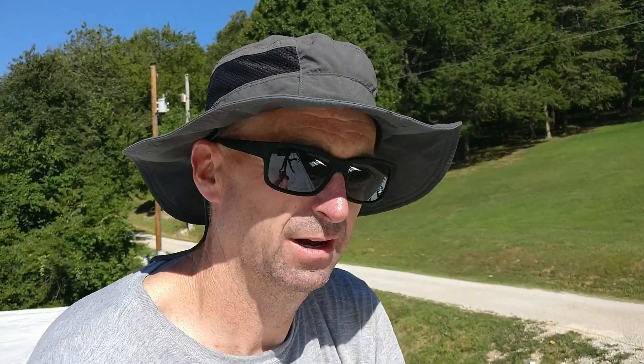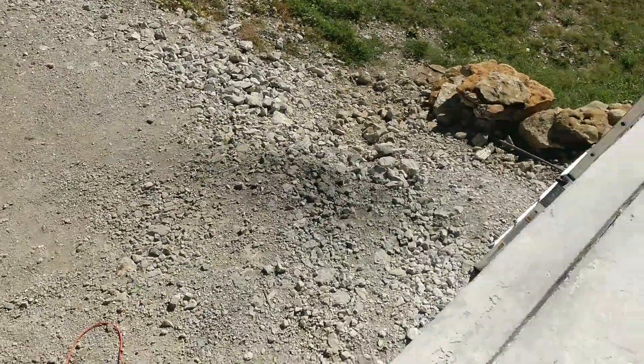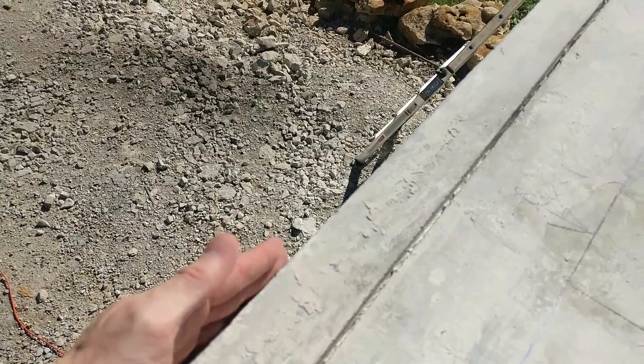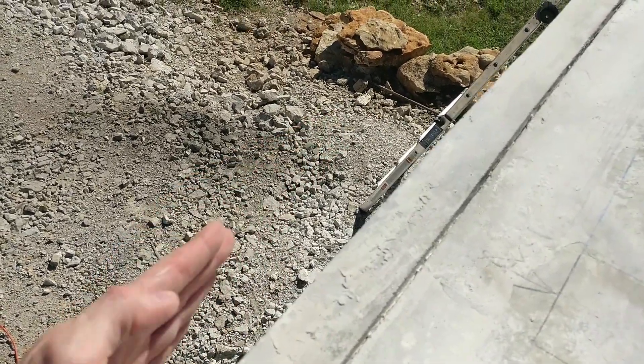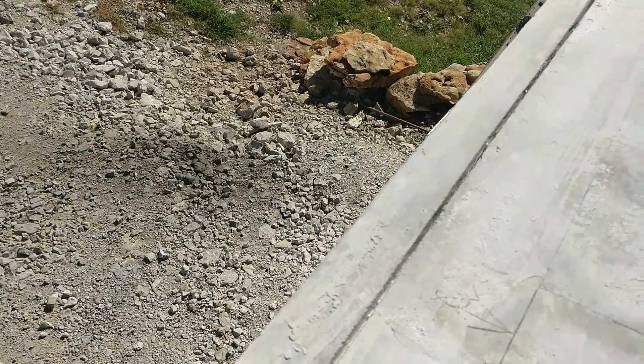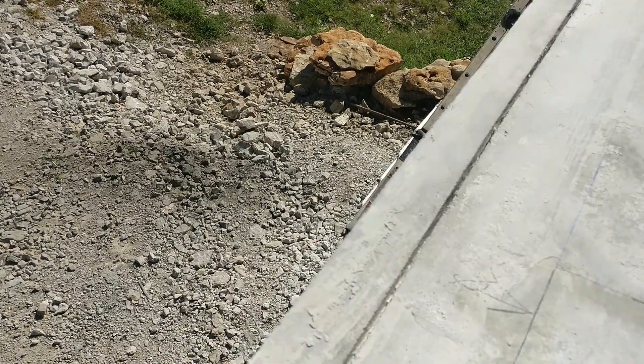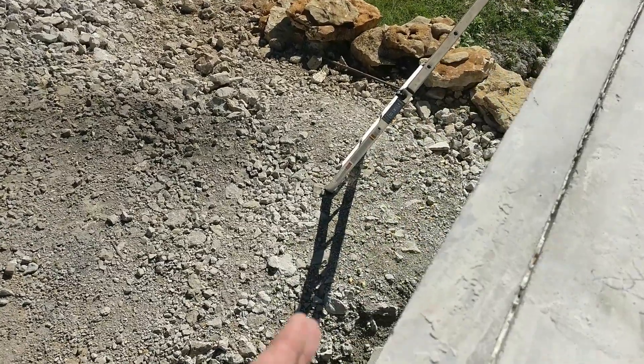Okay, I'm up here on the roof. I had to go get my hat because it is so hot — our heat advisory said 110 today, so it's probably about 105 in the heat index right now. So we've cut the edge here on the front of the house because it had a little bit of a bow to it — the concrete was pushing on that top form ever so slightly. You can probably remember that from our last episode when we poured this roof — we came back and noticed it was just a little bit out of plumb. So they've cut this part straight.